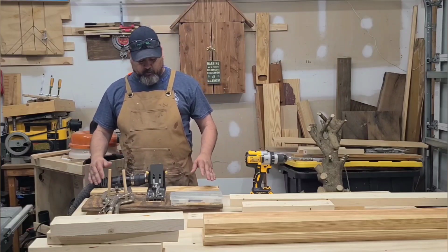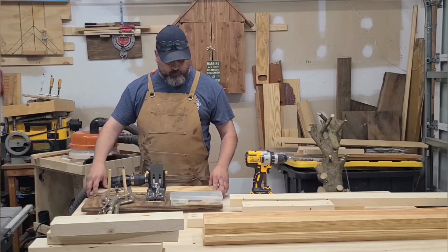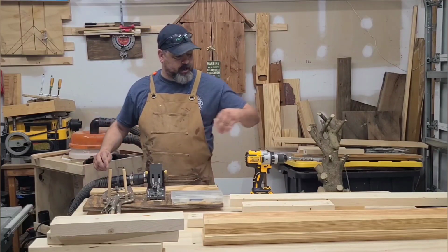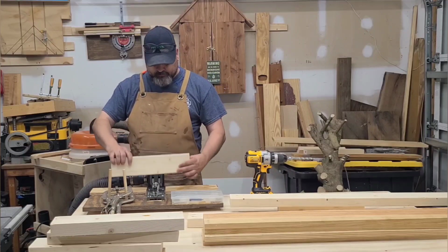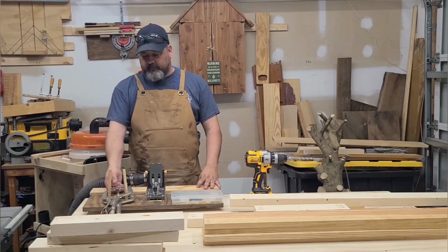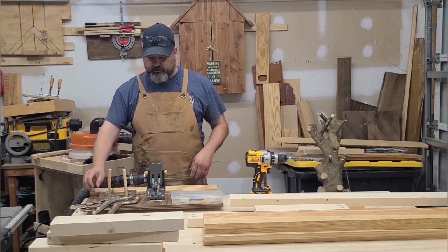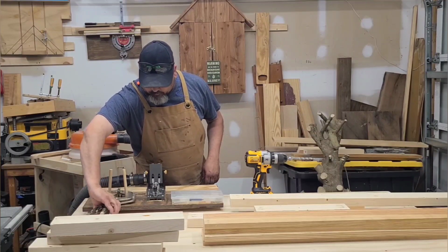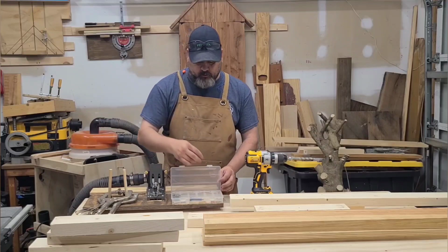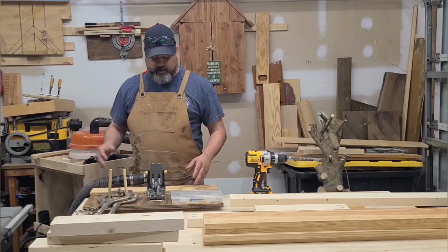I did assemble it on this station here that I can just take with me and go. It's just 3/4 inch plywood all around. I've added these flush runners on the sides, so if I need to do longer pieces, I can without it teetering. It sets nice and level. These two face clamps are just basic Harbor Freight brand face clamps, nothing special. I use those when I'm in the assembly. You'll see those later. And then I attach this small plastic tackle box where I keep all of my accessories for pocket holing in one place, since I don't really need them anywhere else.